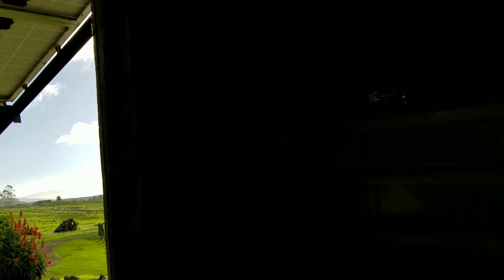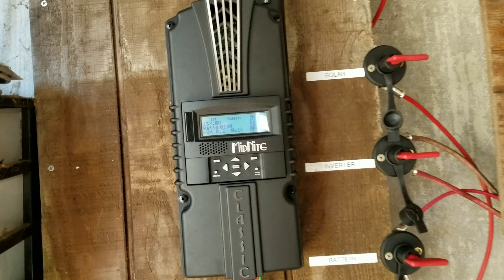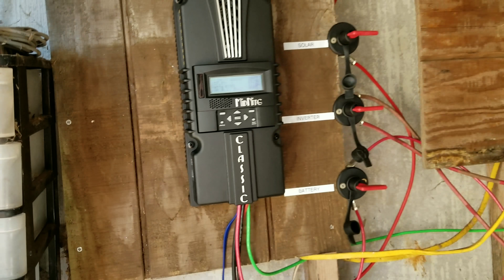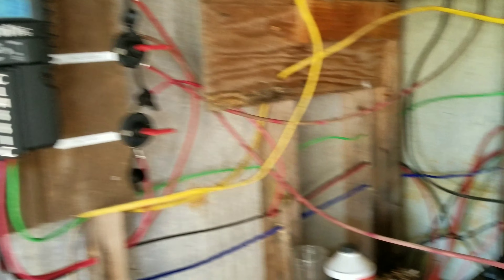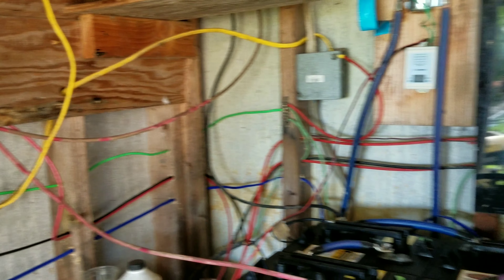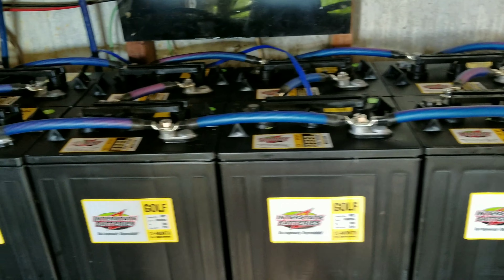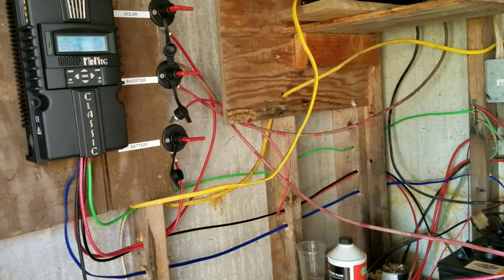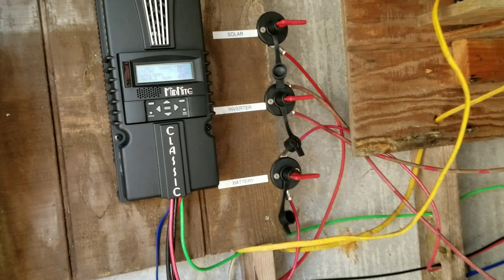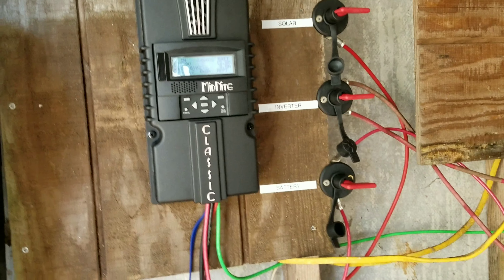This was my project for today — helping my father out. It was kind of unplanned; he told me he bought 10 brand new batteries so I said let's just hook it all up. Originally he was going to reuse the old battery wires, but the terminals were corroded and the wires were really small, so I upgraded everything — all brand new, nice and tight, nice and clean. I tried to talk my father into going to 24 or 48 volts but he wants to stick with 12 volts, which does have its limitations. The max on these charge controllers is 80-81 amps coming in at 12 volts.